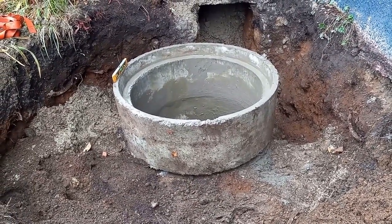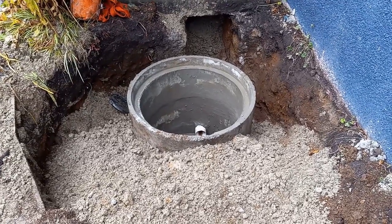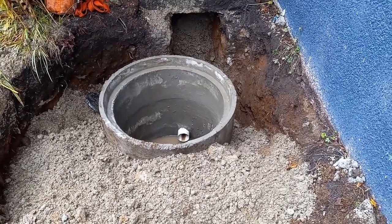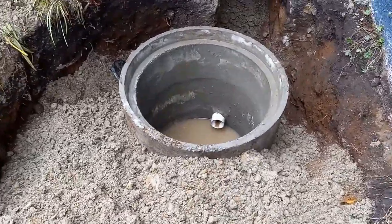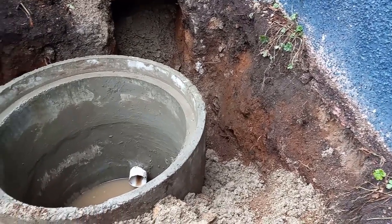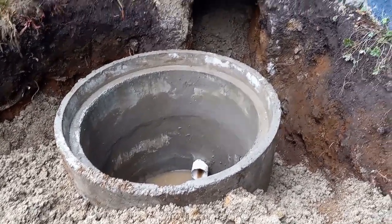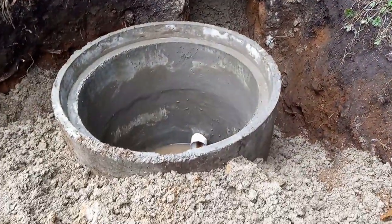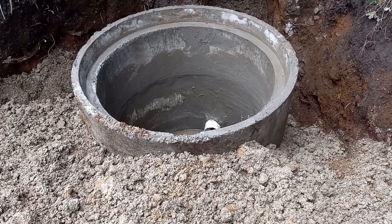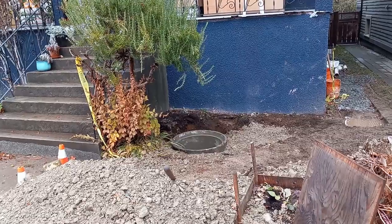The inside is patched up and now I just need to backfill to the brim so I can roll on the next riser. It's important to backfill uniformly on all sides. I backfilled on this side because the first three barrels were leaning toward us — I want the soil on that side to hold against any possible shift and prevent pipe breakage. I'll backfill the other side too, and after the fourth riser is installed I'll backfill the rest. Always backfill uniformly, especially supporting the side the risers may be leaning toward.